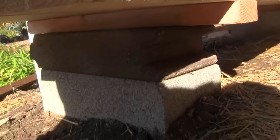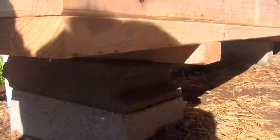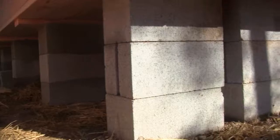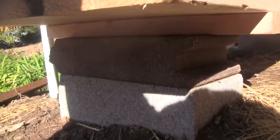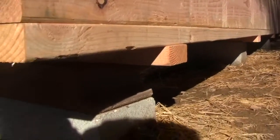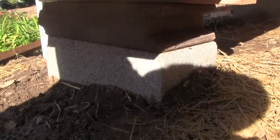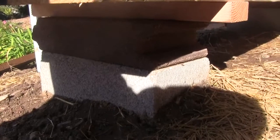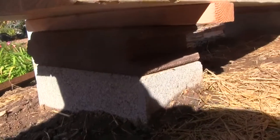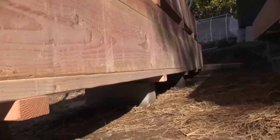Next, we repeated the dry line in order to set the piers. We took blocks and laid them out where we wanted them to be for this table and the other table. We ran a dry line keeping it about 1 inch above the top of where we wanted the blocks to be. Then we dug the dirt or pounded dirt in to get each block set at the right position and the right elevation. After that it's just a matter of stacking the blocks up.